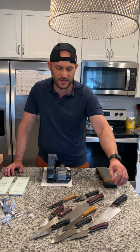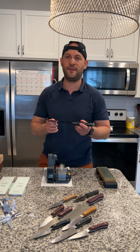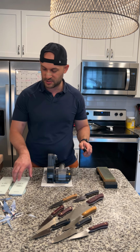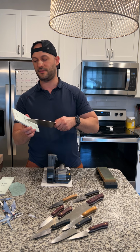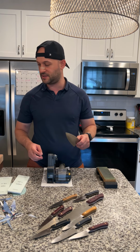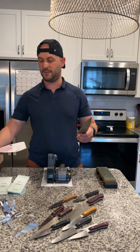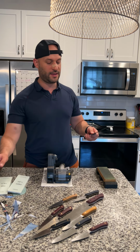Let me just first explain to you some very basic principles. Super important, if your knife is very dull, this one is not. I actually just finished sharpening it, but I can break it here. Let's find some ceramic. Here we go. This is called breaking a knife, okay? I just used the whetstone to completely dull this knife. This knife might still cut paper because it's thin behind the edge. Yeah, it's rough. It'll cut, but it's been bricked. So we want to get to a place where it's flying through this magazine paper.